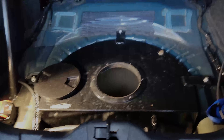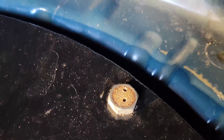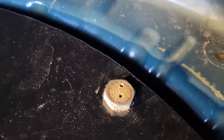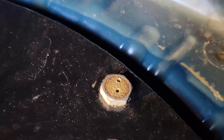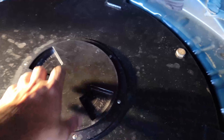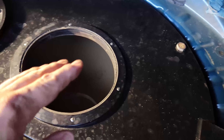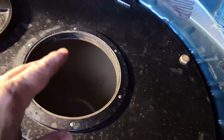I couldn't clean the brass fitting so I just drilled two tiny holes in it — I just want to test it. If it works out I can replace it with something that has a one-way check valve, or literally just a hose flipped upside down so water doesn't slosh everywhere. It's a good little test. We'll see if this was creating a vacuum when plugged up due to corrosion, causing the pump to lose prime. I'll fill it up with water, get the car running, get the pump primed, take it for a drive, slam the brakes a bunch of times, and see if the pump loses prime.